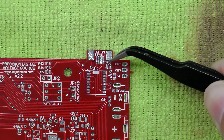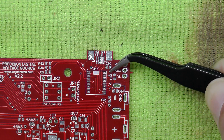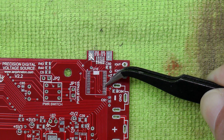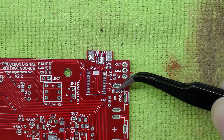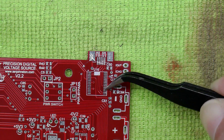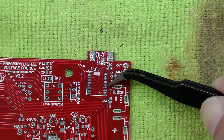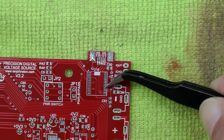Here's a blank board so we can take a closer look. This right-hand end track you can see coming away — it goes onto a capacitor, and the other side of the capacitor goes down through a via onto a ground plane on the underside of the board. The track also goes along to one pin of the IC and then out the other side to C84, which is also a capacitor. The other side of that capacitor goes down to ground via this battery connector. This is actually a ground terminal, and you can also see that one of the adjacent pins on the IC has a little track going away into a via — that's a ground connection, a zero volts connection as well. So it's entirely possible that five volt USB line could be short circuited against that adjacent pin.